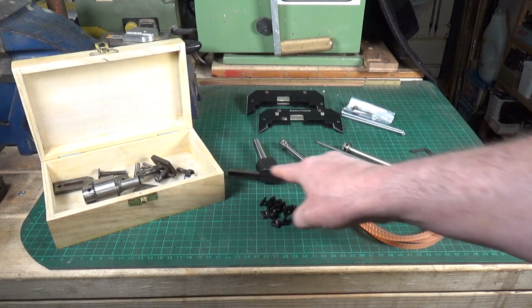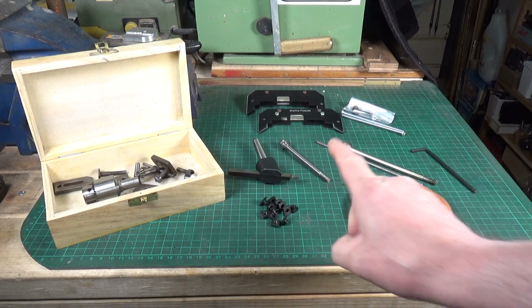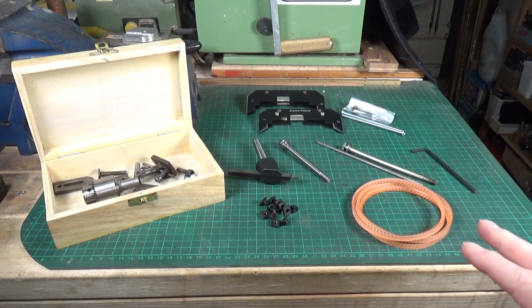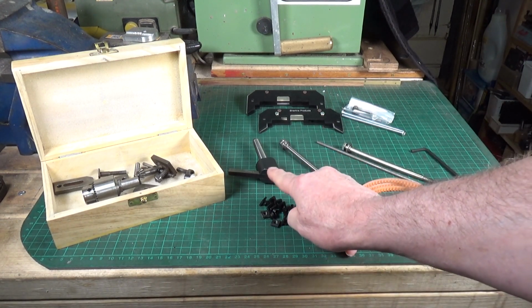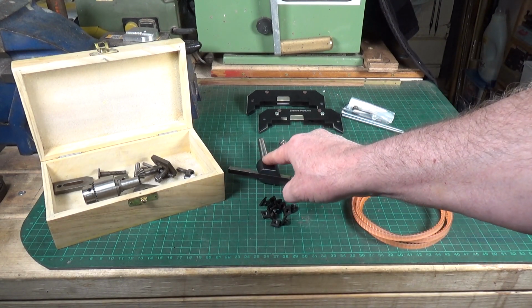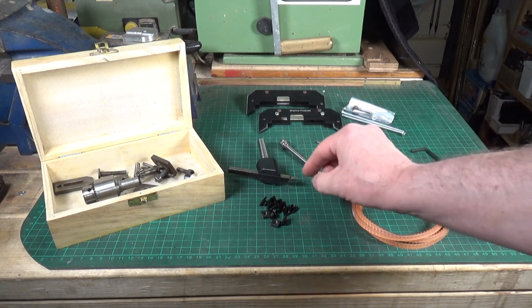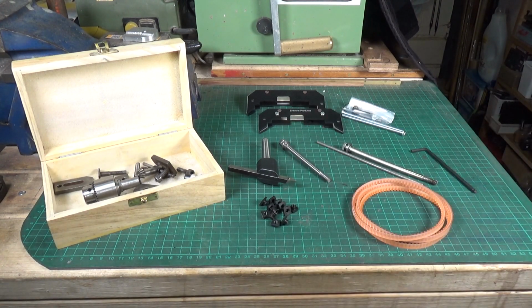I didn't have a cutter, but I do have a load of cutters left over from my very first lathe, which was a Grizzly, a tiny little modeller's lathe. The cutters were about 1/4 inch square, and they fit nicely in the fly cutter head. So I found a relatively unused one which had a rounded tip, and that has turned out to work very well.